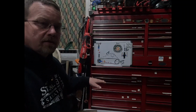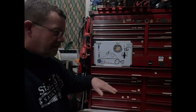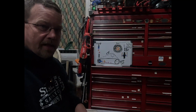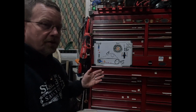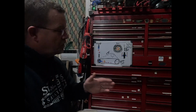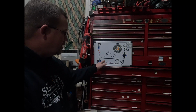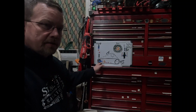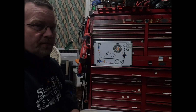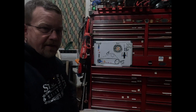Then once you get that all done, go out and play for a little bit. Come back, lift it up again, check your tension again. If your tension's fine, then you're good. If your tension is showing either A, you've got a little too much, or B, not enough, then work it that way. Now, all you have to do is either take out a little grease, add a little grease. Take a little nut, add a little nut. It's real simple.